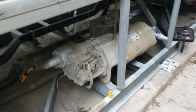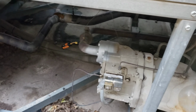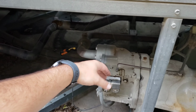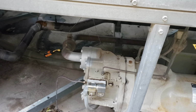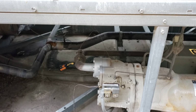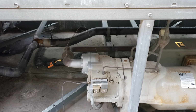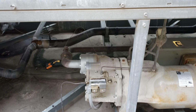All right, so with that test, we did confirm the slide valve in the unloader is stuck. We unplugged the solenoids at the controller, left them to dangle, and we put the magnet on it. Didn't matter which way we went with it, whether to load or unload, my amperage never changed. Nothing about the system ever changed. It was locked in. So that explains the short cycle, right? This compressor can't unload to match the building load. So it's overcooling, it has to shut down. And it was doing that when this compressor was lead. It cycles these compressors based off of runtime, so they all wear equally.